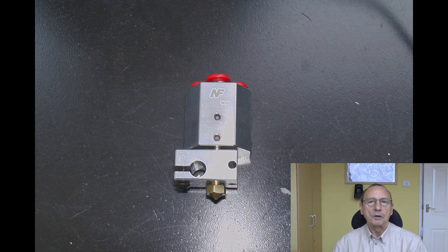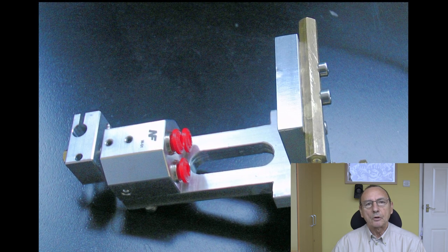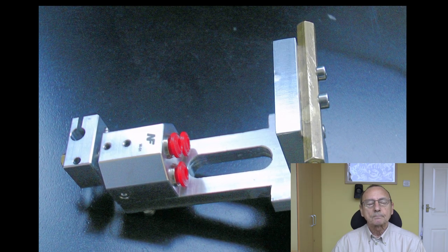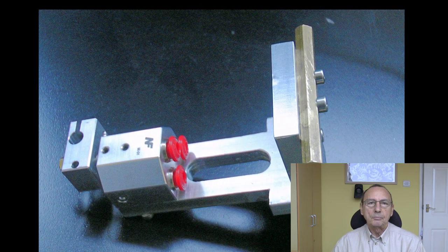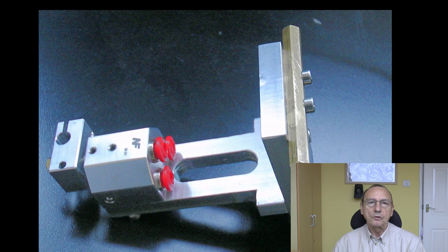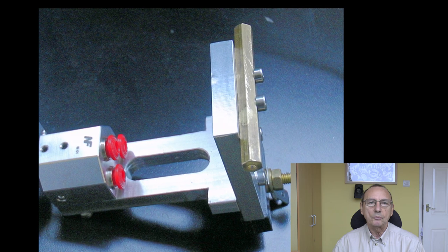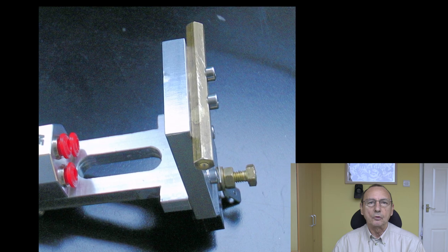Personally, I hate clamping heater cartridges in that way, and I hate even more holding thermistor cartridges in with a grub screw in the side. Obviously, I had to make a kinematic mount on my hot ends. I use the nozzle as a Z-probe, so I've got a kinematic mount. Basically, one side is a hinge, which is that brass part. On the carriage itself, there are two spring-loaded screws with spring-loaded ball ends that fit in the end of that brass part and form a hinge.